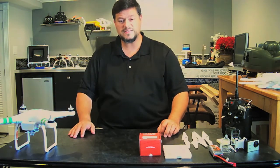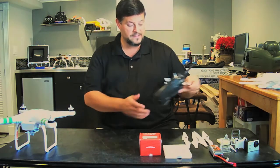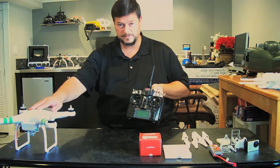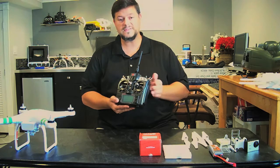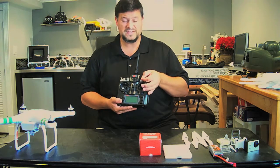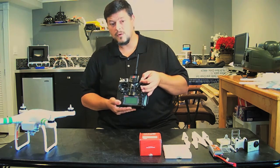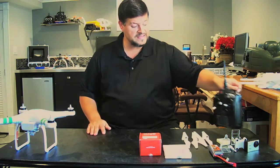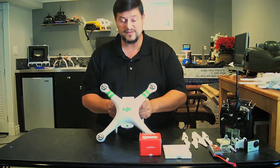Inside I'm not using a standard DJI receiver and transmitter — since it's a DIY build, I went with the Flysky TH9X, which I already use for my other quad copters and helicopters. I put an eight-channel receiver in, bound it to the transmitter, and followed YouTube videos to set up the three-position switch for GPS, attitude (stabilization only), GPS plus attitude, or failsafe return-to-home. There are plenty of YouTube videos that walk you through that setup.